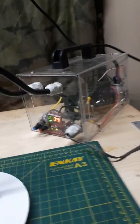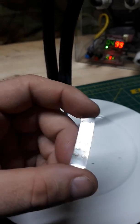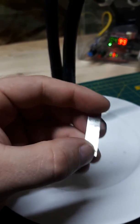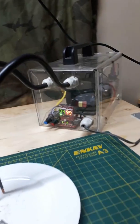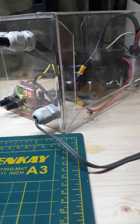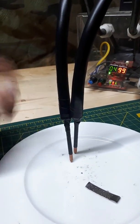I don't have any batteries to weld up right now — I have cells to weld but I'll be building a battery for a few more days. But yeah, pretty easy to make one of these welders. It's just a microwave oven transformer, two and a half turns of two-gauge wire, a $12 eBay board, a couple pieces of copper electrodes, and you're good to go.